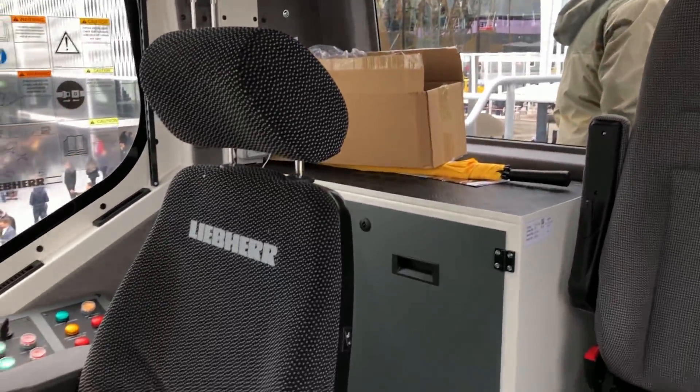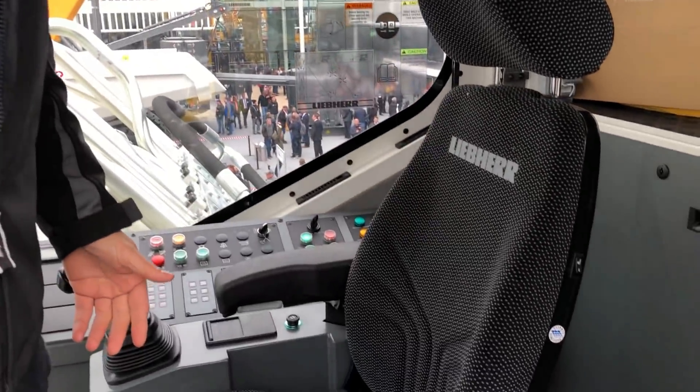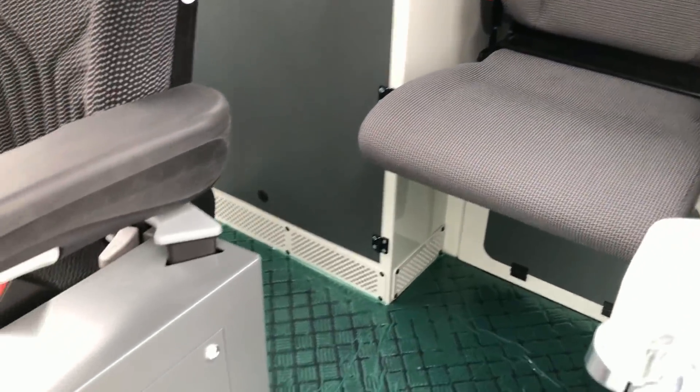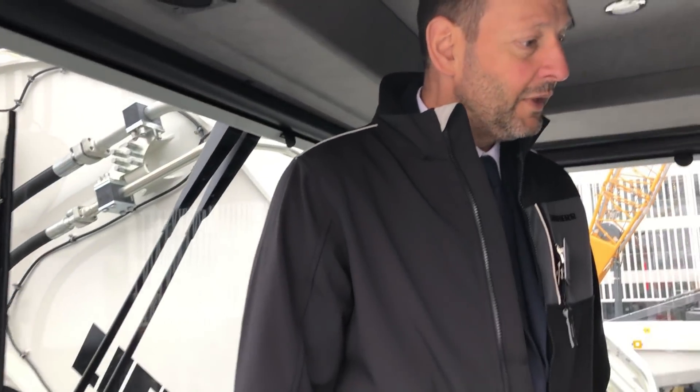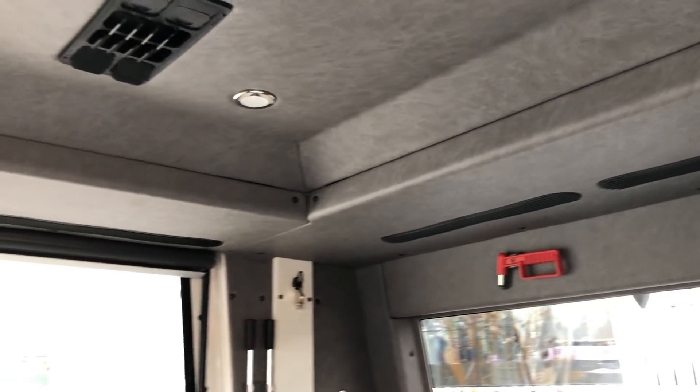See, that's the cab for the 9200. We have basically three different cab sizes for our range of excavators — for the smaller 9100 and 9150 there's one size cab, then we have the middle one, and then the big one. The main benefits are noise cancellation, air conditioning fitted as standard — with a double air conditioning option — heating systems, cold climate options with special heating inside, and a sliding window option for those who want an open window. It's a pressurized cab, so we have a small ventilator at the back with a filter that pressurizes the cab to avoid dust coming in during operation.